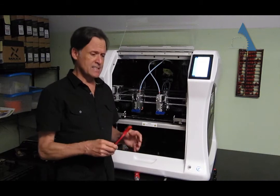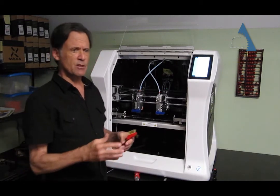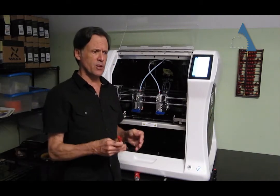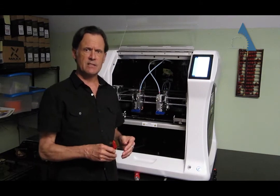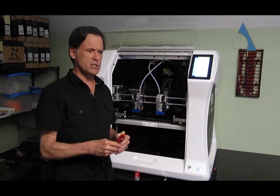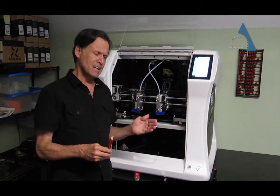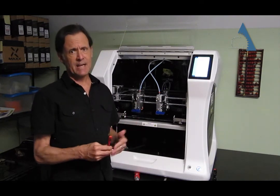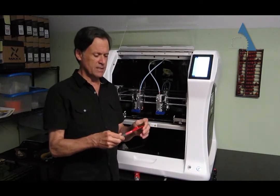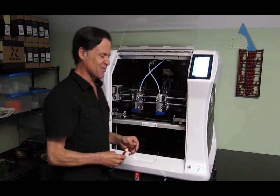You could use the plastic brush, but the stainless steel I do not recommend. The stainless steel brush is a little sharper and harder than the nozzles, and you could damage your nozzles if you really go to town on it. The plastic brush works well, but if you have to heat up your nozzles, depending on what that plastic is made of, it could melt the brush. So the brass brush is the best item for it.